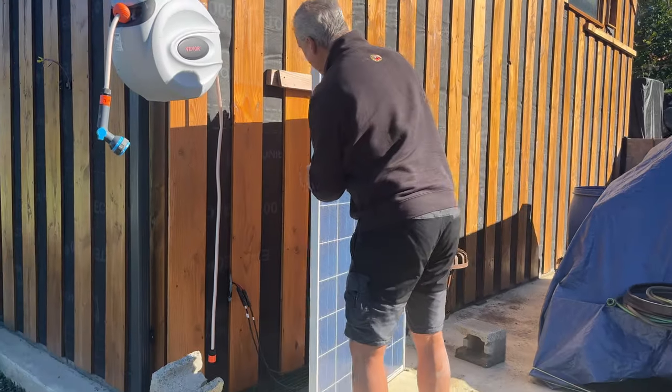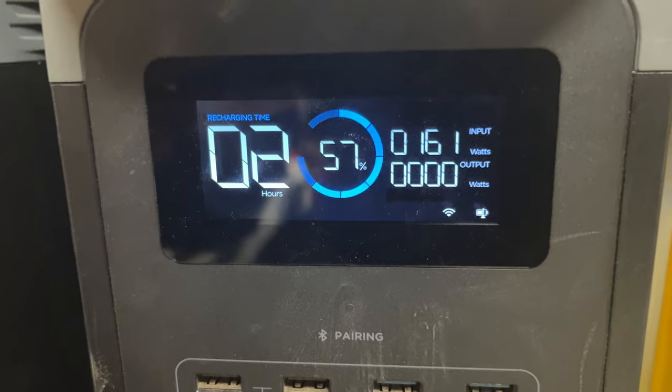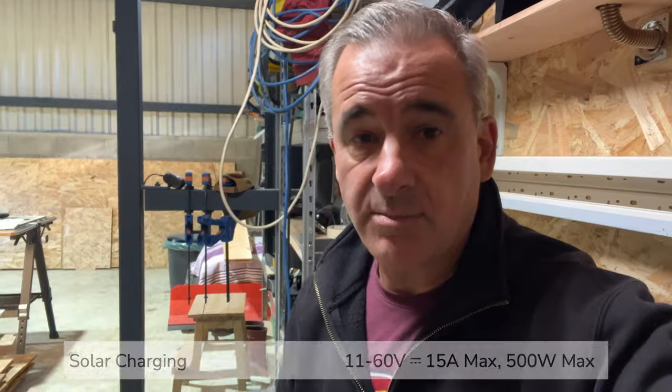Morning, we're back on the plot. I went on Facebook Marketplace and purchased a new solar panel. The solar panel we've got now I bought off Marketplace a while back — I think it's like 200 watts but maximum we get out of that is about 180 watts. And this is what we've got now — we've got about 160 watts, it's about midday, and the max I've seen on there is 180. Now I checked the specs of this Delta 2 and it's basically a maximum input of 500 watts from the solar — I think the voltage is between 11 volts and 60 volts, I'll put those specs up.